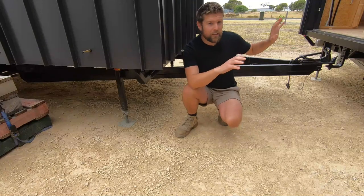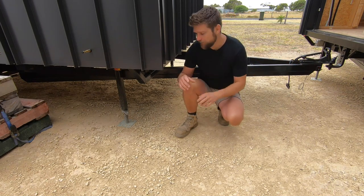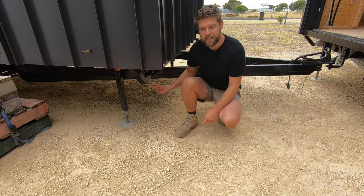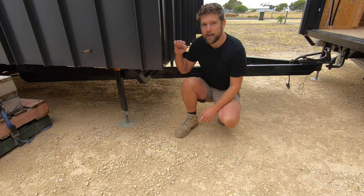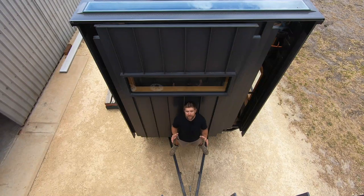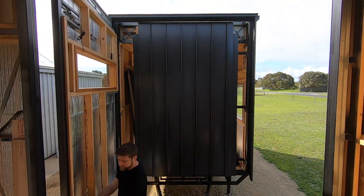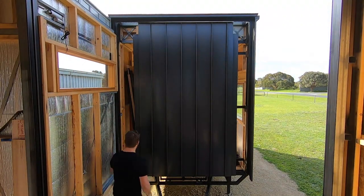This also gives me a datum point that allows me to level the trailers. With the side trailer leveled and the main trailer hooked onto it, I've got a reference to level by. All I need to do is adjust the four legs on this house to level up the main trailer with the datum point on the side trailer. The trailers take about an hour to level up — that doesn't include site work, but assumes I've got somewhere solid to put the stands down. Once that's done, I can open up these walls from the main trailer and swing them around where they nest into the side trailer.